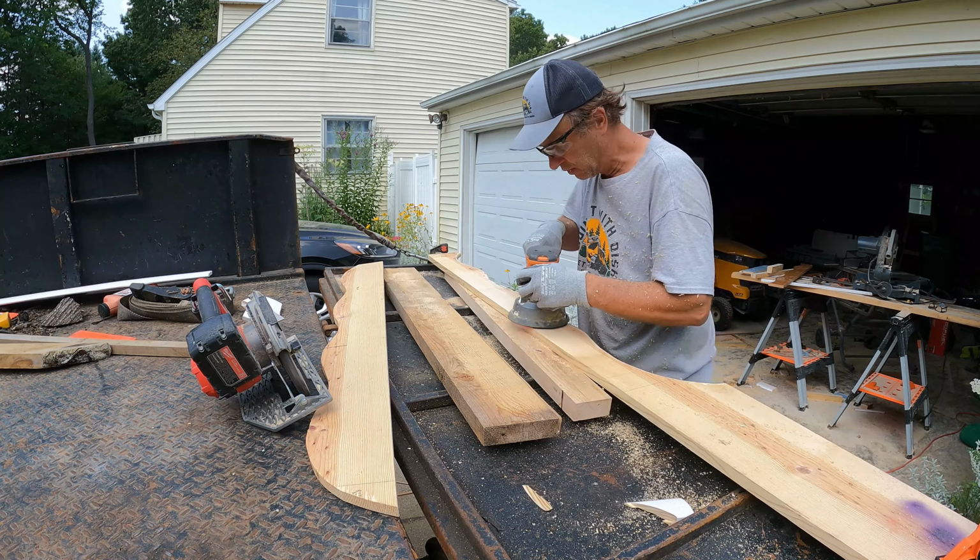So if you got some gaps above your molding like that because your ceiling waves, a little tube of caulk, get some in there, wet your finger, delicately slide her along there. It's not a cure-all, but it makes it look better anyway. All right, time to paint all this. Get the light fixture in. This little part's done.